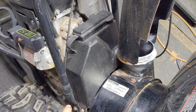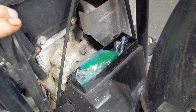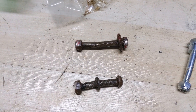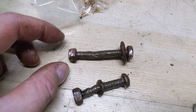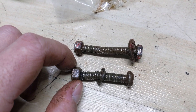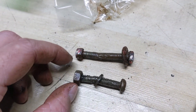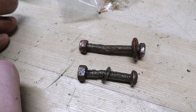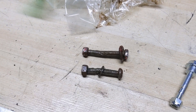On top of a lot of auger belt covers there are small compartments — open them up and inside are your spare shear bolts and pins. Inside that plastic bag were the bolts my customer had installed, and it's clear these are regular bolts and not shear pins — you can already see they've started to bend, meaning the customer has hit something in the past. Not only are these just regular bolts, but we don't even know what grade they are. You could have a grade 5, 6, 7, or 8 bolt — a grade 8 being the strongest — and depending on how strong the bolt is, it may never shear, and again you'll damage your gearbox.